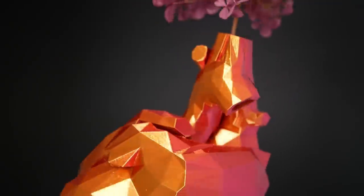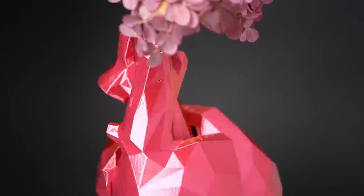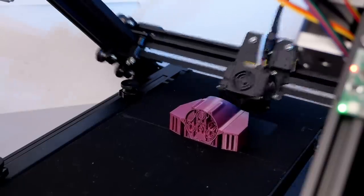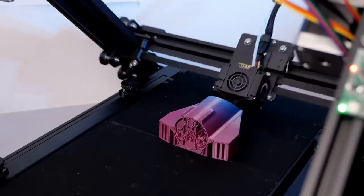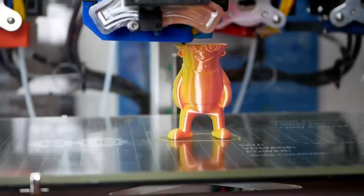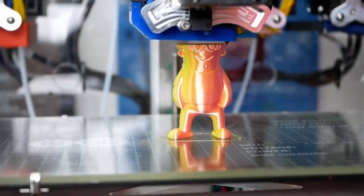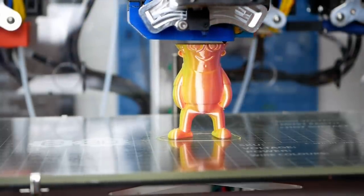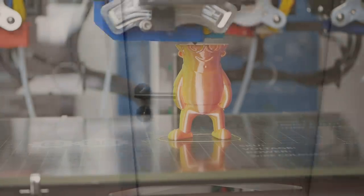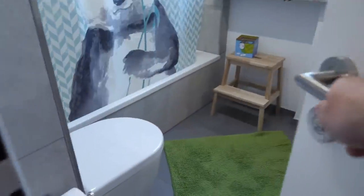We haven't seen anything like that before because making such a filament requires special equipment. Conventional color changing filament can be made with a standard filament extruder where you just add special pigments. This dual color di-chromatic filament is made by co-extrusion. Co-extrusion is something I'm sure you're very familiar with. Let me show you. Come on.